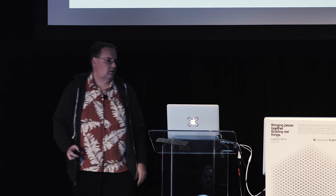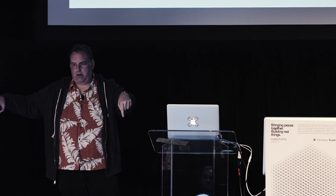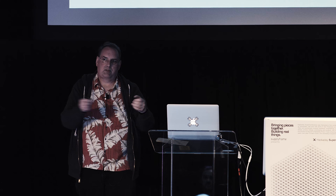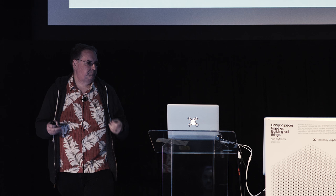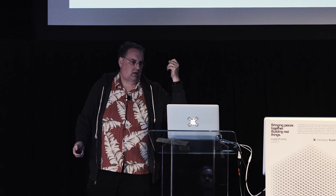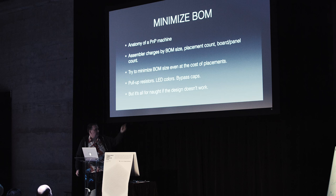Well, you have to start looking at some of the parts of your design. If it calls for a 20K resistor here and a 10K resistor over here, can you get away with putting two 10K resistors in series to try and not have to supply your assembler with a 20K resistor that you're going to use one of? That's the sort of thing that you're going to have to look at. So where it doesn't matter, pull-up resistors, bypass caps, use standard decade values as much as you can. Simplify your BOM. But of course, it's all for naught if it doesn't work. If the change that you make ruins the design, then it's not going to work,